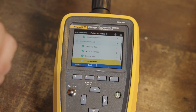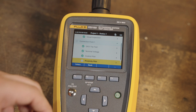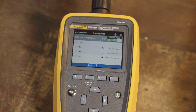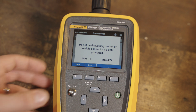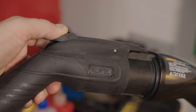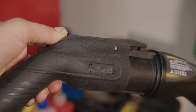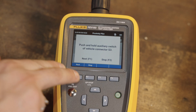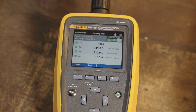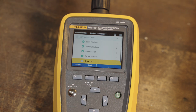Next is the proximity pilot, which corresponds to the little button on the actual charge connector handle. It starts everything up and gives you a little warning: don't hit the button on the connector until you're ready. We hit next, then hold the latch button on the charger. It's just checking the resistors on that switch to make sure the proximity pilot is telling the vehicle to disconnect properly — which it is. You can see the ohm reading on those different states. Proximity pilot passed.